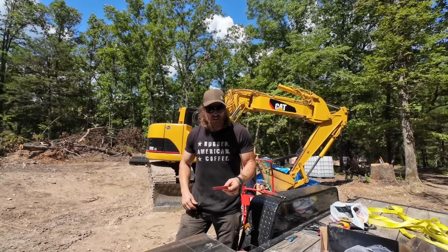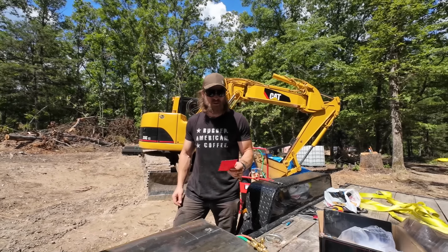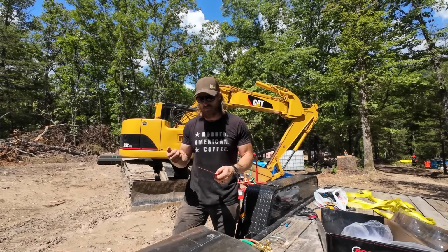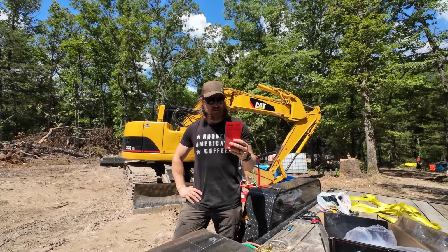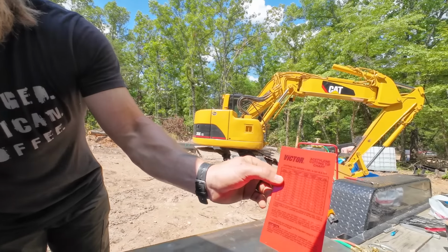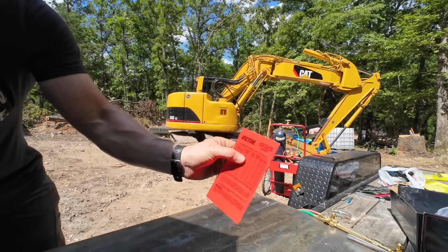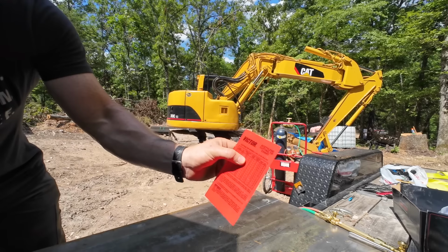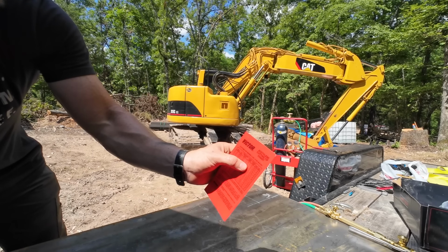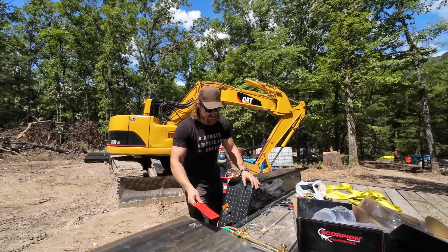Okay, so I mentioned I have very seldom used an oxyacetylene unit, and every time I have, it's been someone else's rig. They're just like, oh yeah, it's already set up, boom, go. Well, I got one of these little Victor cards. I think it's mainly a tip chart. Based on the thickness, we're going quarter inch, so we're using a double aught tip. Slow, fast cut, so 20 or 25 PSI for the oxygen, preheat oxygen 3.5, and then the acetylene pressure 3.5. Well, I guess I'm gonna figure out if these things are shut off.